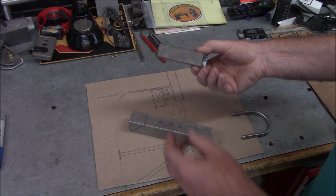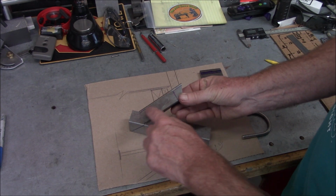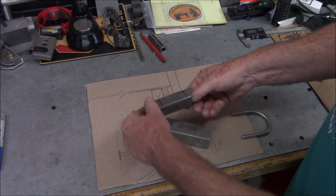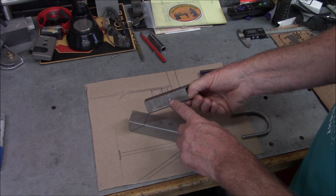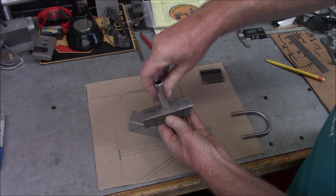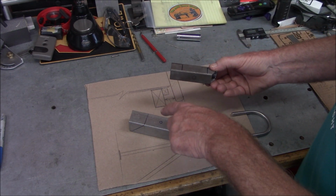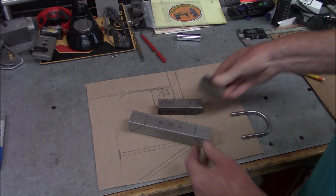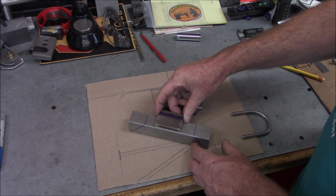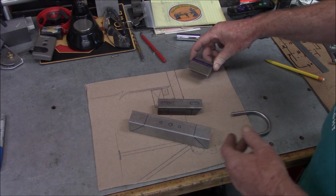And then I've got this piece of 1 inch. I'm going to cut it out into a T-shape like you see there, with some slots for the U-bolt, a clearance hole in the back. I've got to also put a hole in here so I can get a socket through to tighten up that bolt. And then we'll put a slug inside this tube, drill it and tap it 3/8-16, a couple of rosette welds to hold it in there. And that should do it.